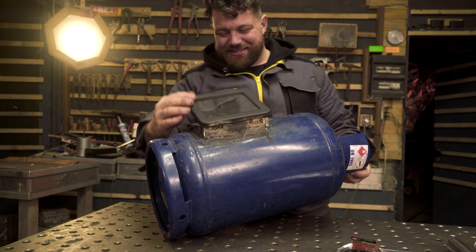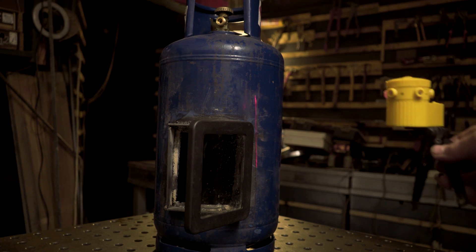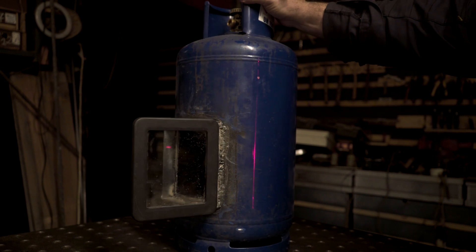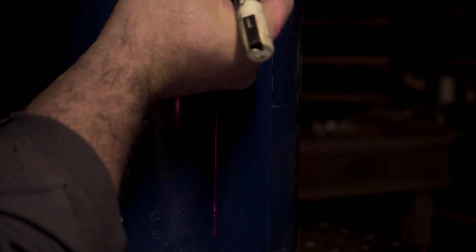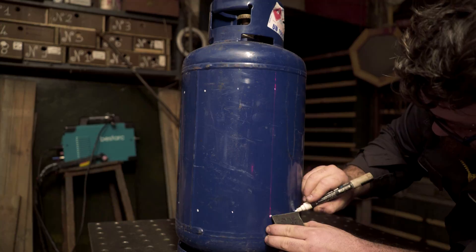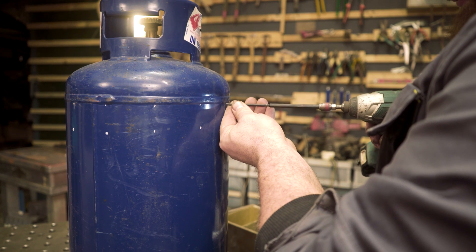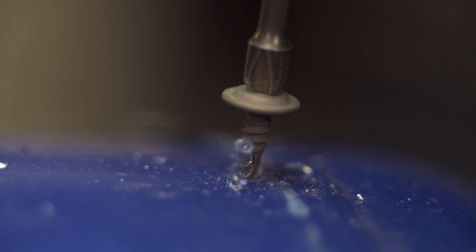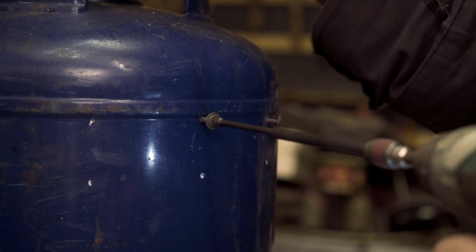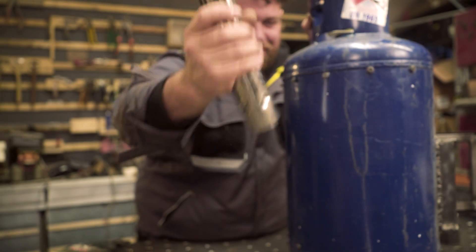Now it's important to use a laser level. This helps a lot to go faster. I have to mark precisely 16 points on the gas tank with a white marker, and having a laser level is so handy. I use a plastic spacer to have everything precisely spaced, then use self-tapping screws to screw into the stainless steel. This is pretty tricky since these screws are usually made for much thinner materials, but I place all 16 screws without problems.